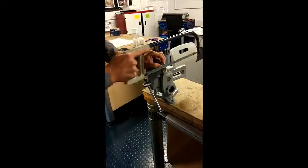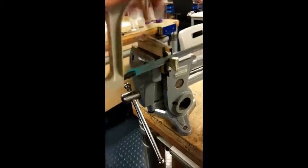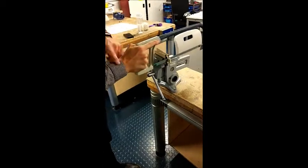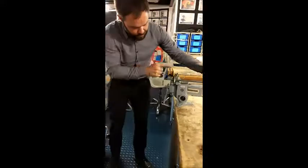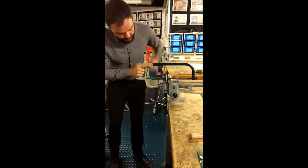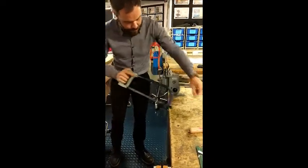I'm cutting on the forward stroke and just drawing the blade back. You'll notice when I'm cutting using the hacksaw I'm pointing my finger like this — this is keeping the saw straight. If you find you're having trouble keeping the saw level, you can hold the front of the hacksaw as well. I don't want to add pressure but it just ensures I keep it level. When I get close to the end I'll just support the last bit of sprue so it doesn't drop, and just take that through like that.